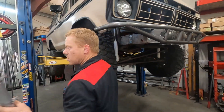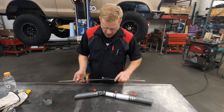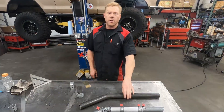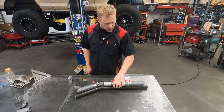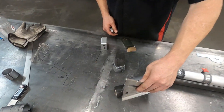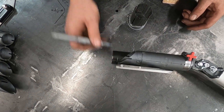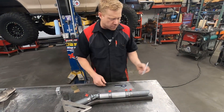The next step is going to be to transfer this over to the final tube. First step is to figure out what our bend angle is — just using a protractor here, looks like 30 degrees is our bend angle. We've got our tube bent, and the next step is to set our jig on top to figure out where the ends are going to be going. Using a speed square on this side, we can transfer that mark to the tube just like that. There's our end cut.